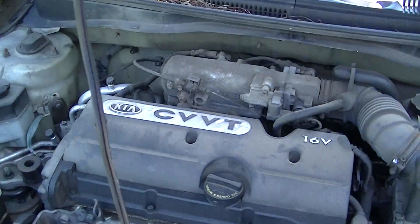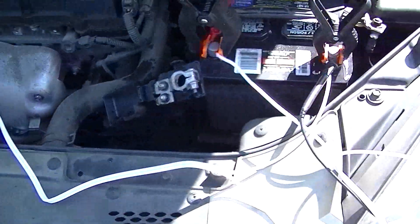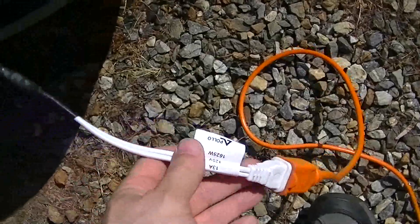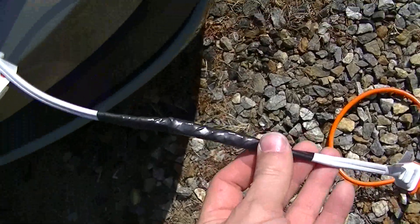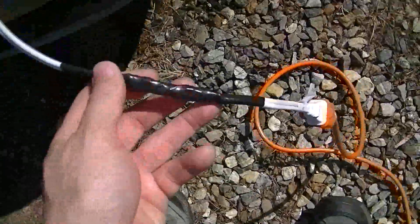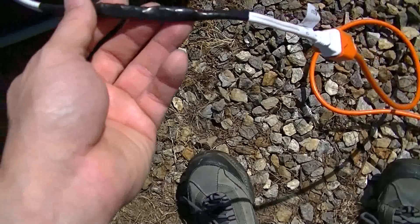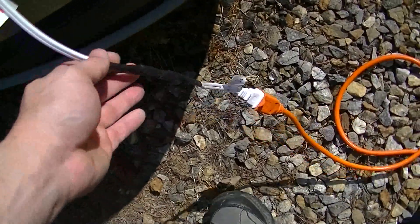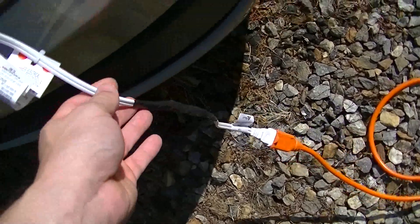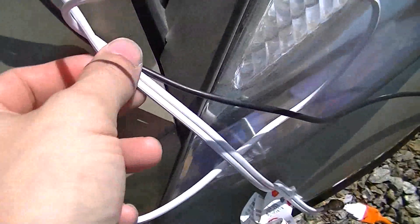I will post a link to a website where I will have the drawing on how to do this. What I've done is I took the cord, cut it, and put a diode in it. The diode I'm using is rated for 1000 volts, 1 amp. To get higher amperage you'd parallel the diodes; if you need higher voltage — though 1000 volts is more than enough — just put your diodes in series. I've cut the cord and got a split right here.